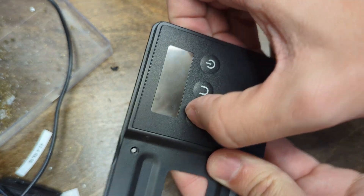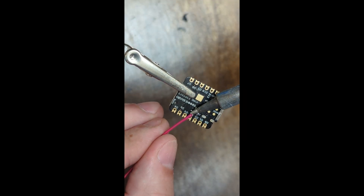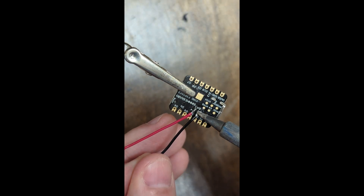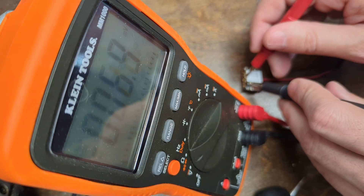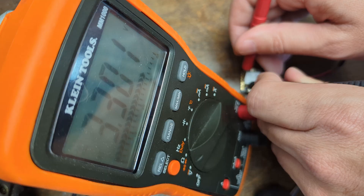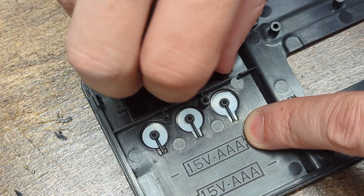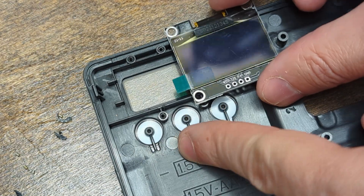Since I'm using a battery, I had to solder in the battery connections to the bottom of the XIAO. I'm using the ESP32 Seeed XIAO, and once I got the battery installed I did a quick check — yes, we're getting 3.3 volts, no problems. Next was the work for the display, and fair warning this is going to get a little grotesque, because the built-in display is fine but I wanted a different one that didn't fit — but we're going to make it fit.